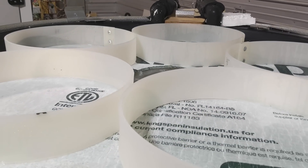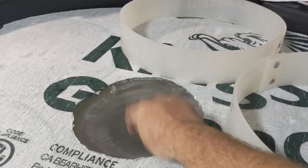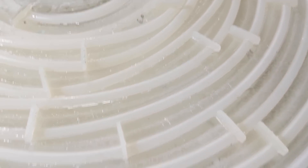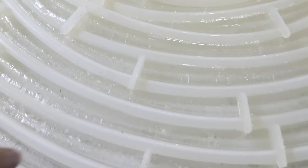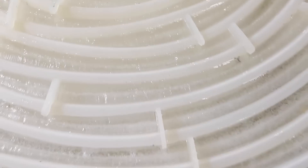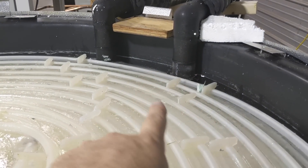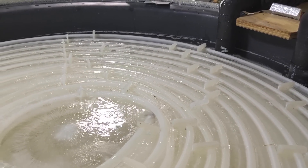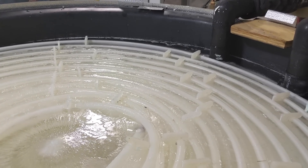I'm just showing you inside the CalMac — I'm seeing solid ice right there, awesome. You can see this PEX cassette — I'm calling it a cassette — and this is solid ice. The glycol from the chiller runs through the cassette. There are manifolds with two-inch pipes coming in, and you can daisy chain and stack these ice tanks together, which minimizes the external plumbing needed.